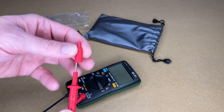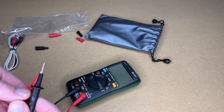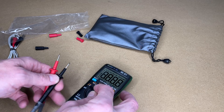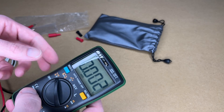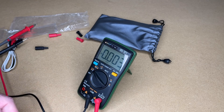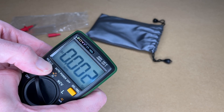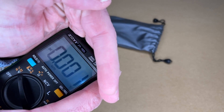With the sheath on it's CAT II 1000V or CAT III 600V; with the sheath off it's CAT II 600V, so removing them changes the safety rating. I don't deal with high voltage so I'll probably leave mine off. Switching to volts — it also has a kickstand so you can prop it up at an angle. If you hold down the blue button it activates the backlight.